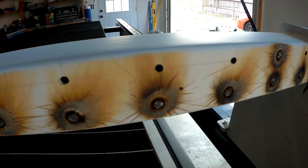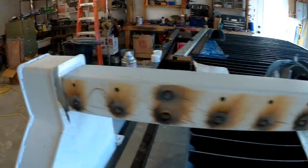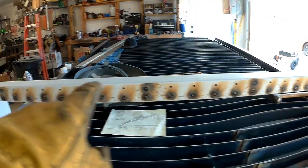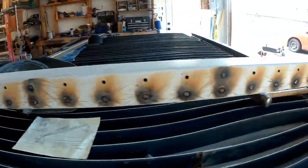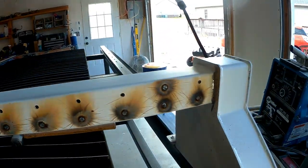Alright, I marked all the bad holes and went ahead and filled them up with welds. And now I'm going to go back through with a flap wheel and buff them all down smooth. Then we'll get the V-rail mounted back up there and make the bolts that we can, mostly along the top there. As you can see, basically that bottom row — I messed something up on the elevation. There's always a way to figure it out, especially with welding. That's the beauty of it — it's not carpentry. If you've got something that goes wrong, just add some more metal to it and start back over again.